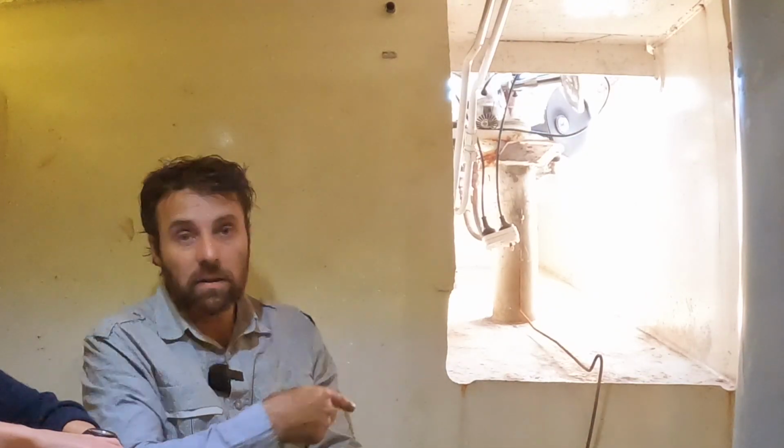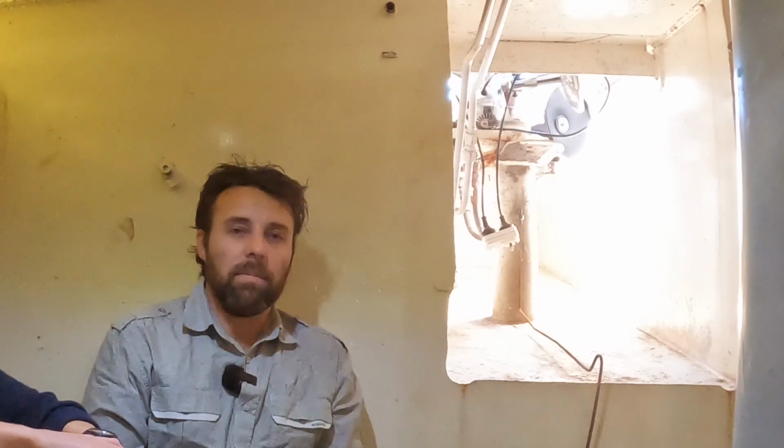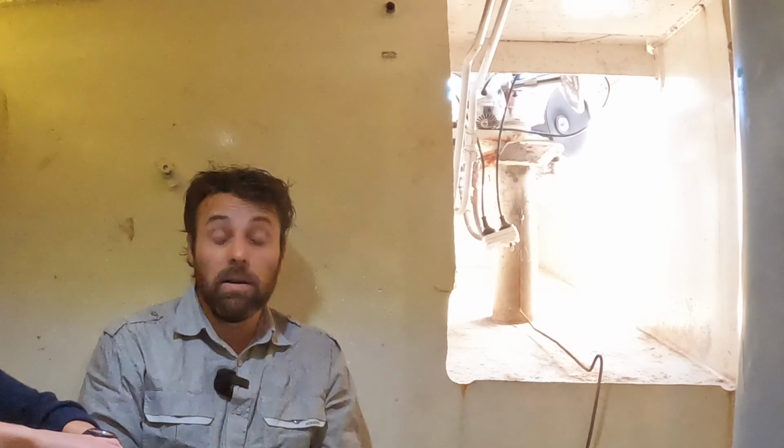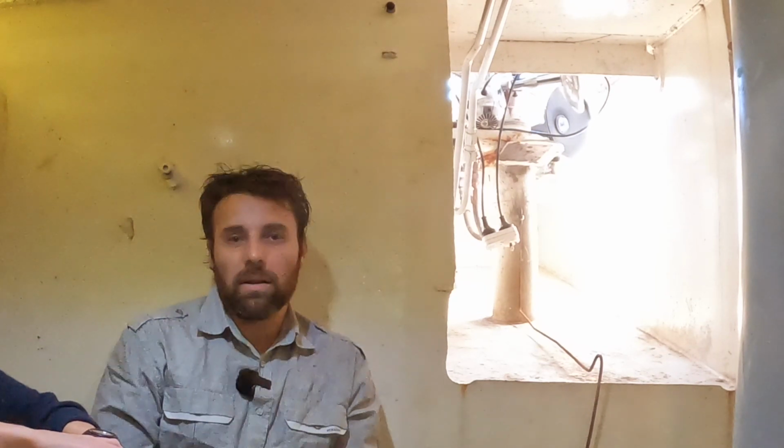So today's job is basically make gaskets needed to seal this up, putting the bolts on and tightening that up nice and tight, and then bunging up all of the fittings so that we don't have air leaks, and pushing in a couple of PSI of air pressure and walking around with a little soapy sprayer and see if there's any leaks anywhere. And if there is, dealing with that, getting in there with a TIG welder and cleaning all of that up.